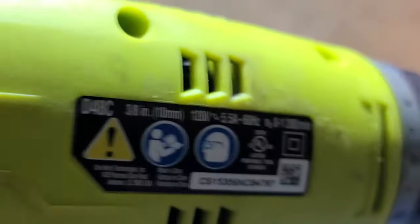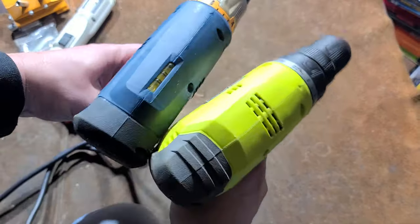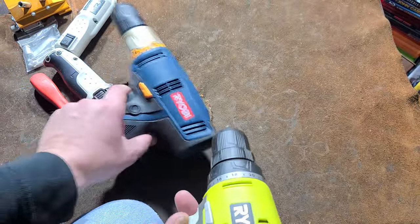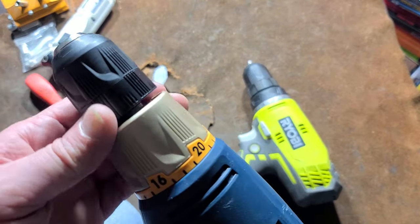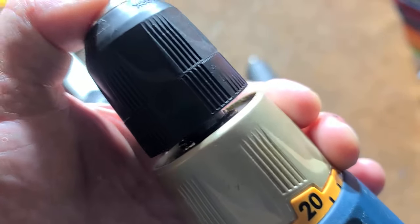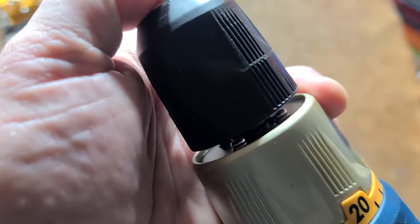They did make some changes. The biggest change is 5.5 amps at 1200 RPM versus 4.5 amps, so they give you a little bit more power. They both have little vents up front to help give some cooling for the gearbox. But one thing they did — they probably cut an inch and a half or almost two inches off the length of the old one, so it's a lot smaller and more compact. I'll give credit that a slightly longer gearbox gives longer space between the two bearings that hold the spindle straight. And being a die-cast metal gearbox, the bearings are held tight. The D47C gets credit for its cast aluminum gearbox and actual ball bearing spindles — the metal gearbox really keeps it tight. This is a really nice tight spindle on this drill.